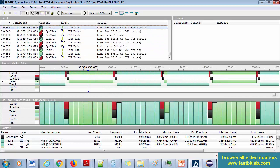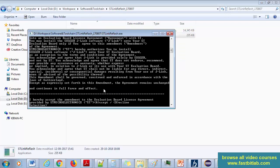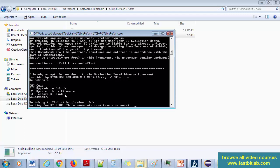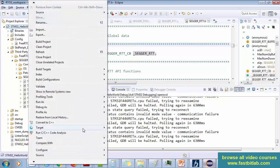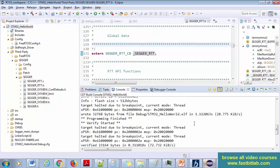To revert back to ST-Link firmware, go to your software's toolchain folder, launch the reflash tool, type 'a' twice, then select 'Restore ST-Link'. Make sure the board is connected — it will restore the ST-Link firmware. The restoration completes and the Nucleo interface appears. Downloading code works without any problem, so the ST-Link is properly restored. Try this at your desk and let me know if you face any issues. Next lecture we'll analyze the trace.